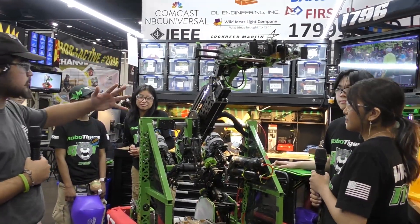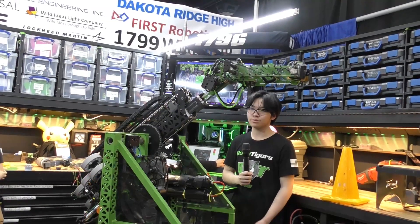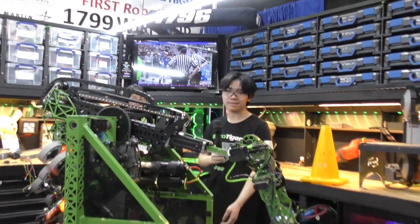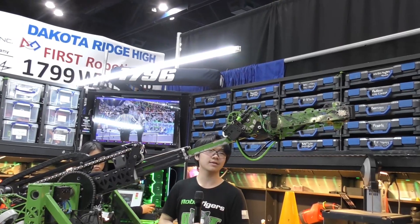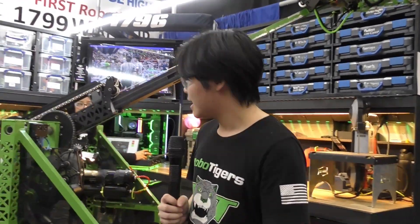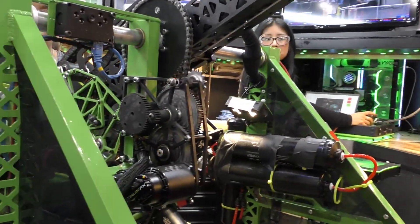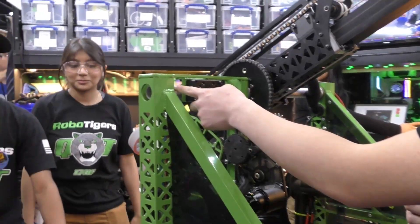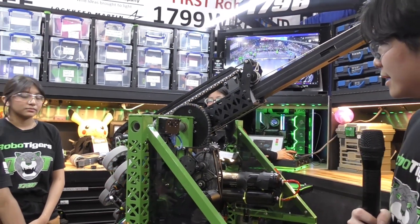Can you show us your arm extension and your levels for each node? Yeah, Jeffrey can demonstrate it. So for our arm, we have three different positions set up for scoring. First, we have the low position, which would be this position right over here. Next up, we have the mid position, which would be this right over here. And lastly, we have the high position, which would be that right over here. In order to get these positions, we created some custom gears so we could put a CANcoder here to calculate the absolute position. We decided to 3D print the gear assembly here so we wouldn't have to mount the CANcoder directly onto the arm pivot, as that would be too hard. So we created this custom mount and placed it there.